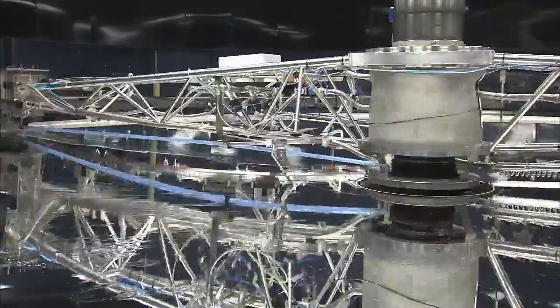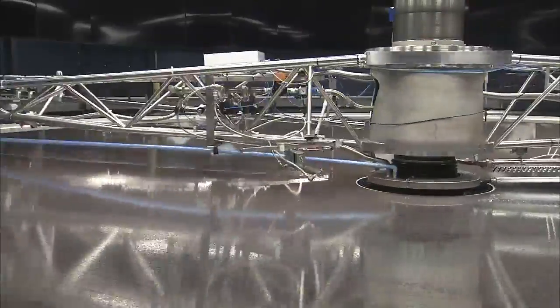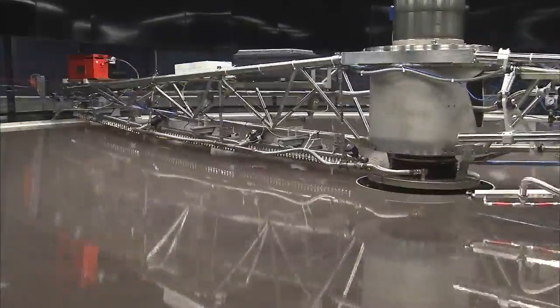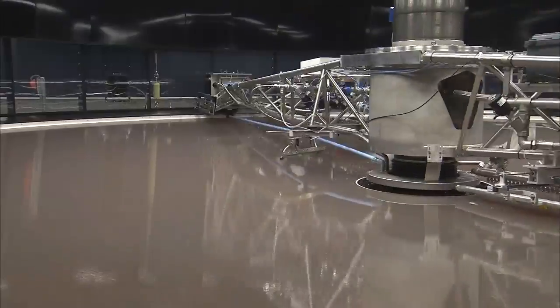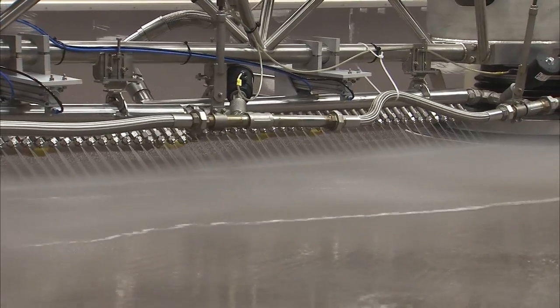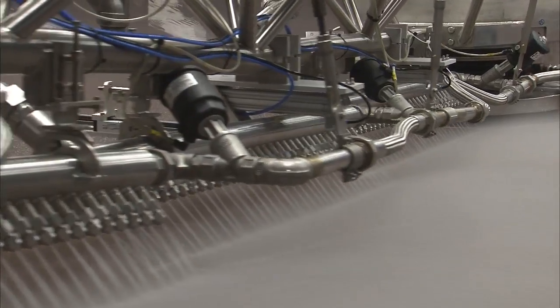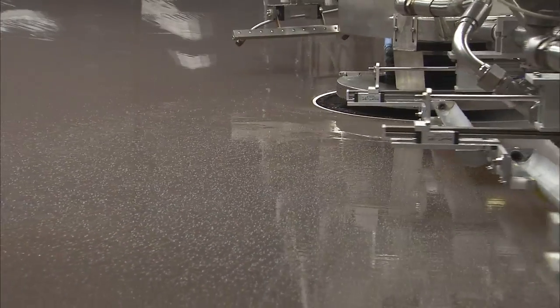In the next stage, acid is used to remove the old aluminium coating. The real amber colour of the dish appears. The mirror is made of special ceramics that don't deform under temperature changes. Again, the mirror is rinsed intensively to provide as clean a surface as possible. Once done, all the liquid is pumped out, and the mirror is ready for the vacuum chamber.